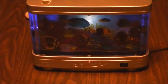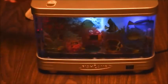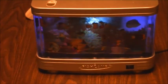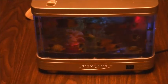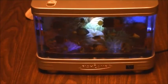And we've got a total of six LEDs sitting in this thing, and these LEDs are each rated for 3.7 volts. So yeah, I've got 6 LEDs in here, and they're all running off of a 3.7 volt battery. Now when this battery is fully charged, of course, it's about 4.2 volts, full power. That's just the nature of lipos. And, you know, all batteries overcharge above their normal rating. But this should run for several hours on end.